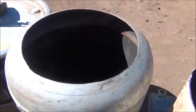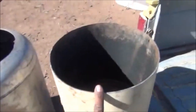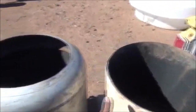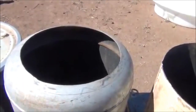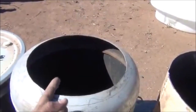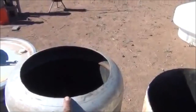I want to quickly go over something on the design. If you notice right at the tip of my finger here, there's this black line carved in here going all the way around — that's the actual true dimensions of our reduction zone. I'm actually going to have a slight reduction from the tank even from what the actual size of the reduction zone is. That will allow me a small air gap and a downspout area where our air inputs are going to be, to constantly keep clean. With a little bit of overlap here, there's little chance something's going to go back upward and stay there — it may get in originally but it won't stay. So it's going to make our airflow a lot more reliable with a small amount of overlap.